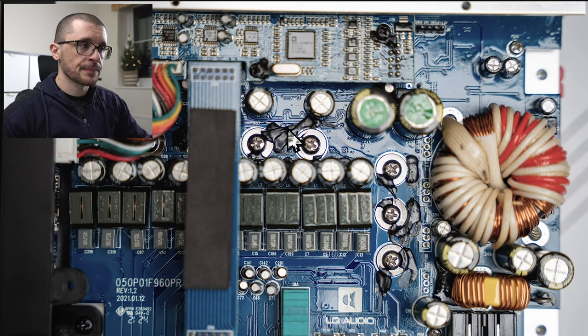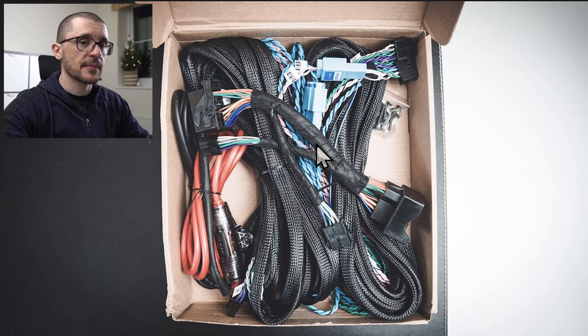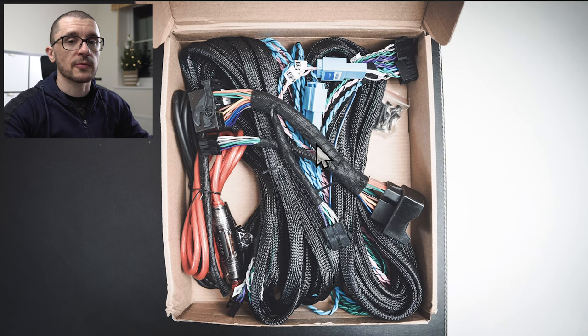Here I'm able to see something that was a bit strange — I'm tempted to consider this rubbery, plasticky substance as something to prevent vibration from getting these screws and bolts undone. By having this type of setup, they are ensuring that those transistors are still kept in contact with the heat sink. Let's take a look at the wiring harness, as this is something that often gets neglected, although it's quite important. Signal is taken from the front part of the car next to the head unit, sent all the way back where the amplifier is placed, amplified, and then sent back to the same connector at the front — after which it goes on the normal wiring harness to the speakers. The quality of these wires and how they are connected is quite important for the quality of the sound. Overall, the couplers and wires used are very compatible and very similar to the OEM wiring you would normally see.